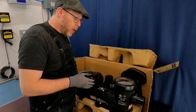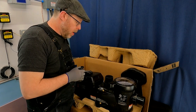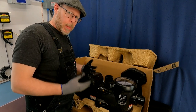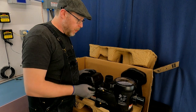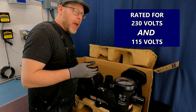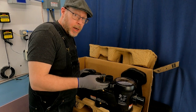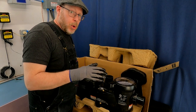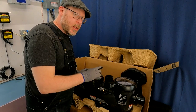This pump at 1.85 horsepower is very powerful and it's intended for 230-volt applications. Remember, this pump is the one you buy from a brick-and-mortar dealer — a swimming pool and spa professional. One of the advantages you get for doing so is that this pump is dual voltage rated. It's rated for 230 volts, but if you had 115 volts — let's say that's all you've got available for your pool pump right now — your options are going to be limited, because there aren't many pumps on the market that move a lot of water at that voltage. But this one does.